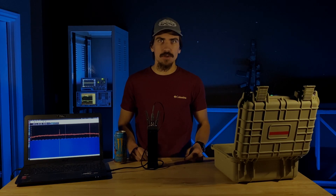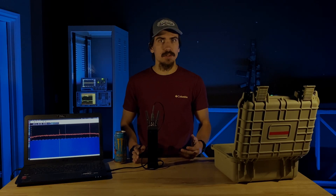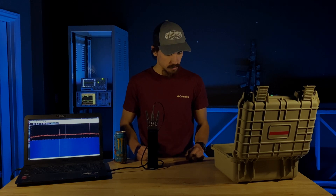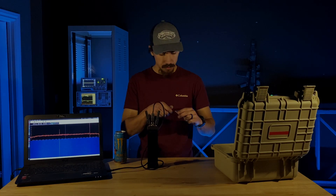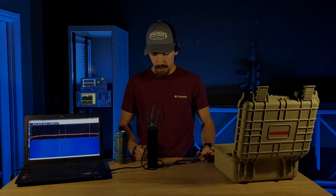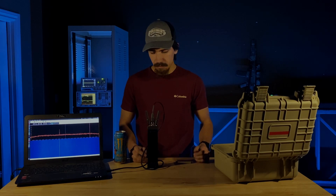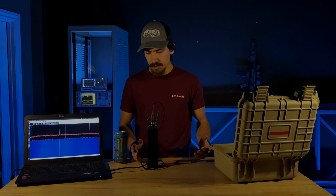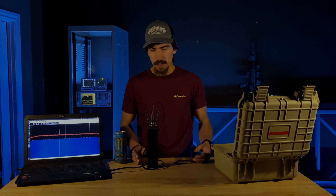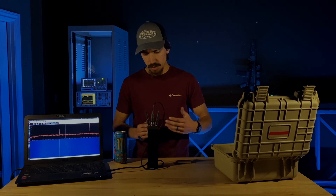The second problem is the bandwidth limitation. You might notice there are two antennas on this — that's because there are two RTL SDRs inside the SDR Stick. It's essentially a ruggedized USB hub specifically designed to hold two RTL SDR dongles. When you get yours, you unscrew the connectors and nut from your SDR, pull it out, plug it into the provided USB port inside the SDR Stick, connect the end cap connectors, and you're good to go. Two is better than one, but this is truly a system greater than the sum of its parts.